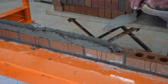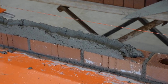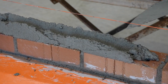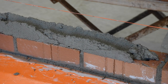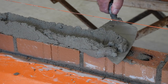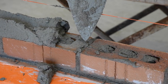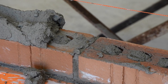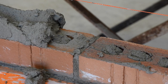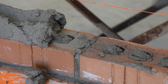We talked about that head joint being 80% full. I've spread over the top of that head joint, so let's remove the mortar and see what the head joint looks like. I was 80% before I spread. Let's remove this little bit of mortar right here and check this. If you'll notice, that little void on the top right there is perfectly full now.